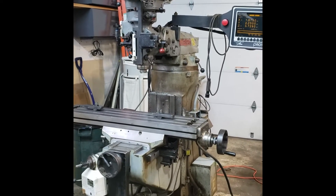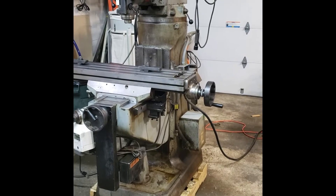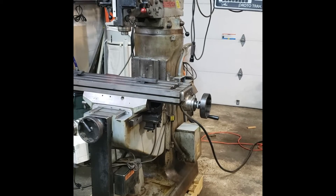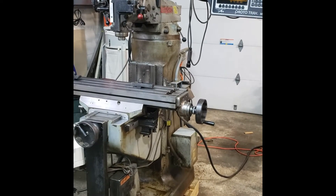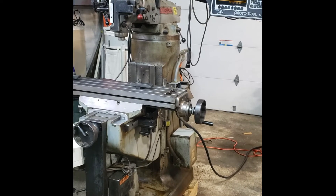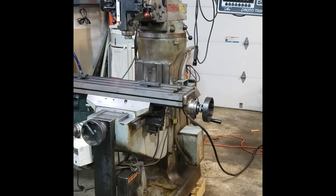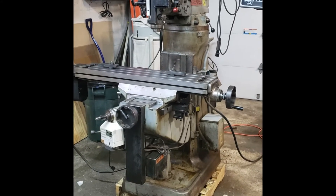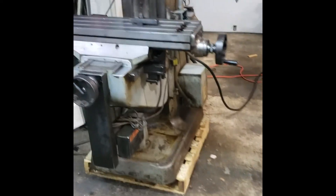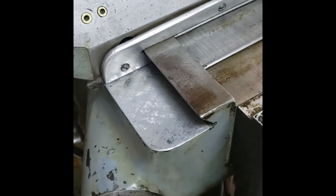We hustled today — we got the machine pretty much put back together. There's not much more I could do as far as looks; I don't have the room to take it apart and paint it, and the paint that's on there is chipping anyway. I'm satisfied that the ways are in good shape. I fixed the oilers, repaired everything as far as the ball screws getting lubed, all the tubing — everything's epoxied in. It's nice, it doesn't leak; you get a nice oil film between the table and the front way, and I'm getting nice oil on the Y-axis dripping down on both sides.